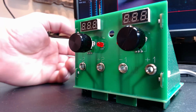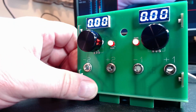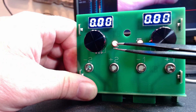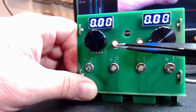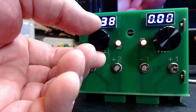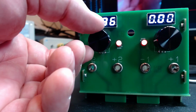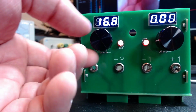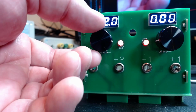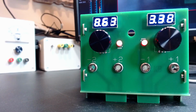This is going to oversaturate the camera when I turn it on. These LEDs are a little bit on the bright side, but you can see that we do have our status LEDs just to indicate that they're on. These little voltmeters, they are calibratable. So you can see that I have calibrated these so they do go to 0, and up at the higher voltages, they are accurate. Being a dual power supply, I can actually wire these in series.